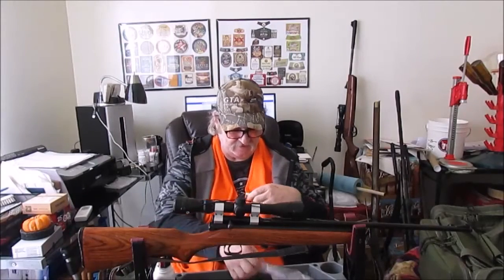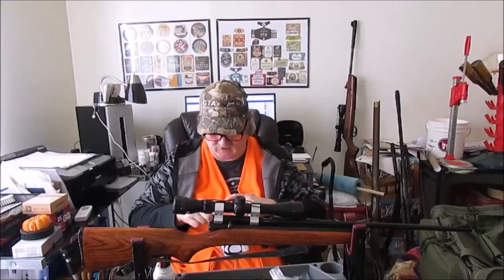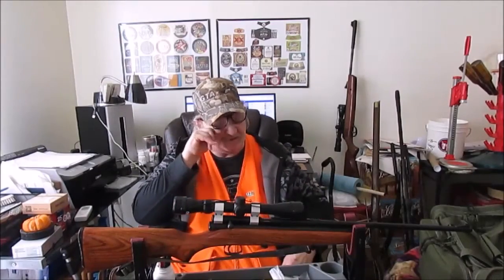But anyway, that's the new valve that goes in about there. And we're going to hope we can get this back together today and be able to shoot it and see what kind of velocity numbers we get out of it. I know the stock Crosman valve was 500, 550 feet per second. So with the H&N Barracuda Greens, which are 12.65 grain, we'll run a few of those through here and see what we get. Right now, I'm going to spend a couple hours stripping this thing and then get it all back together again.